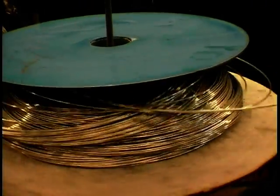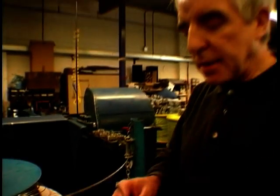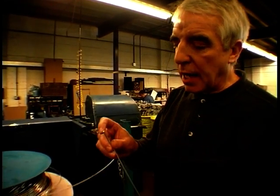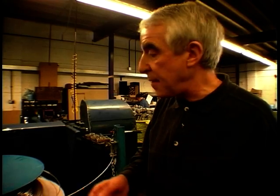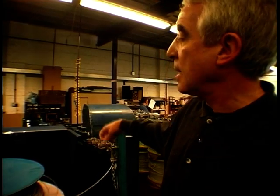Well, this spool of stainless steel wire is going into this spoke machine, which is going to head the spokes, like on this one just here, and cut them to length. So as it goes down, it goes through the rollers, through a cropping machine, which crops them in two stages, and then it bashes the head over, and spews it out at the end.